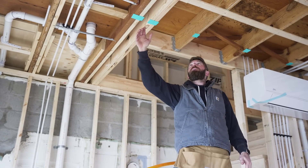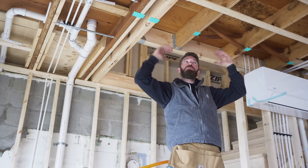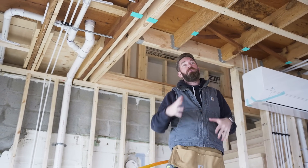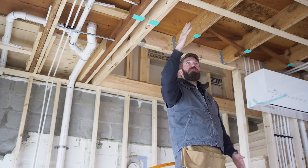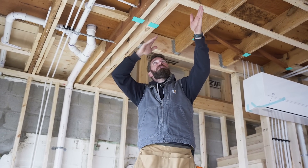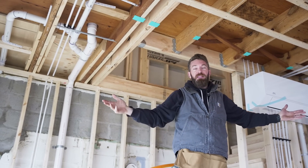What we're going to be doing is trying our best to isolate the drywall from the wood structure above it. Normally you would just fasten the drywall to the floor joist, but then you've got these long continuous ways for the sound vibrations to transfer from the joist to the drywall and then down into the main living space.